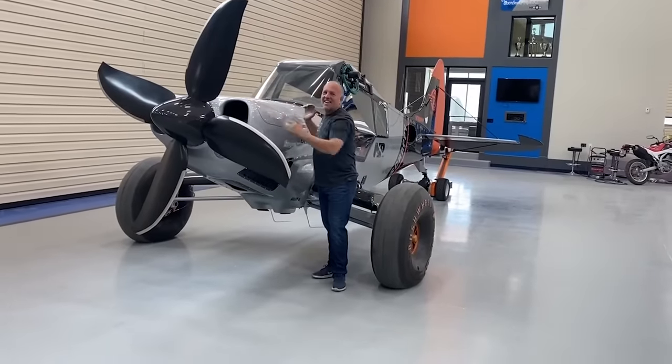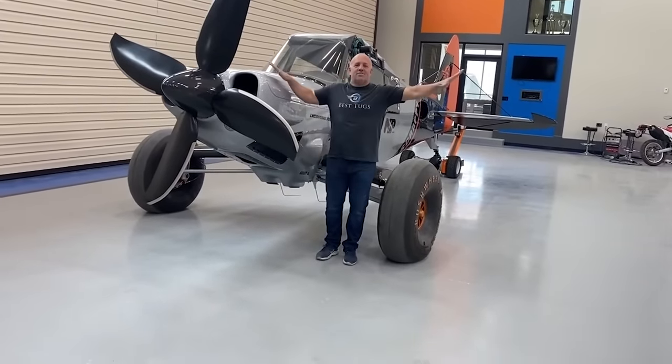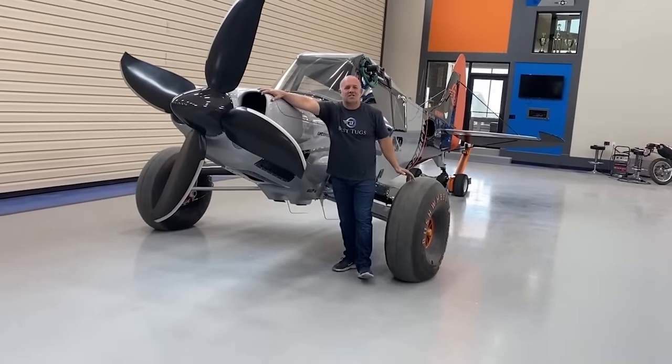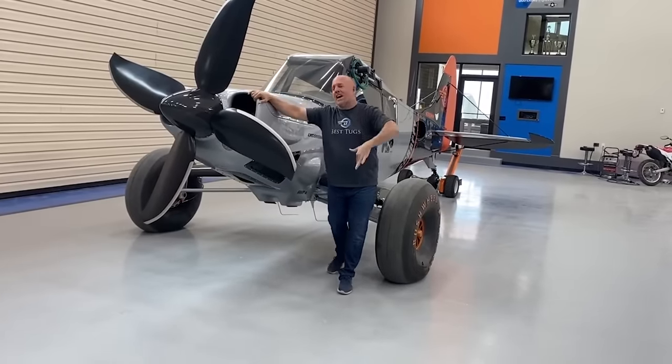It's just like any other tricycle gear aircraft, no angle of attack to the wind. Here's what Scrappy looks like in safe taxi mode. Tails up, fronts down, gear splayed. Suspension is locked out so it can't rock a wing. I'm safe, I'm stable, I'm locked down. This is also the easy get in and out mode and the tie down mode. This is where we tie it down.